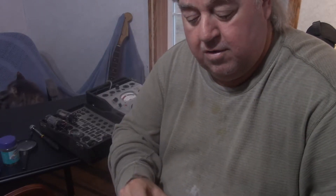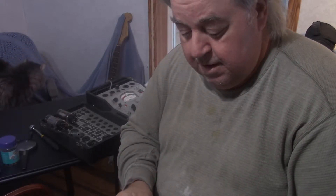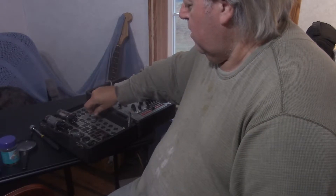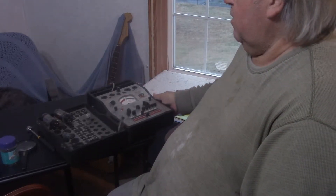Here's a couple of really nice RCA black plate 12AX7 tubes, and both of them have had the vacuum released out of them. They've turned white, and when they're white on the top they're no good. You can test them to make sure, but I guarantee it is going to test bad.